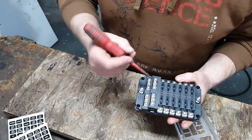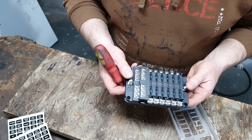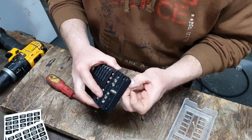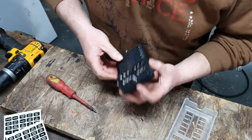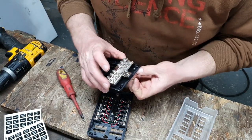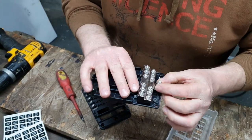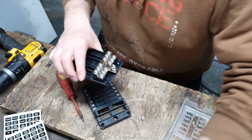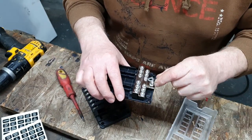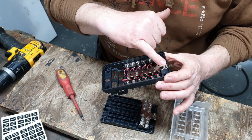I'll demonstrate that shortly. And then basically we connect our negative supply here - either directly to your battery via a fuse or a switch. That in turn wires these 12 systems, these 12 switches - they're all connected to negative. I'll show you continuity between all of those. Continuity is just a very simple measure of whether there's a circuit path between the two. Inside, our negative bar is basically all connected together. When you put on your ring connector, which I'll show you in a minute, it gets clamped down and that makes this all negative.